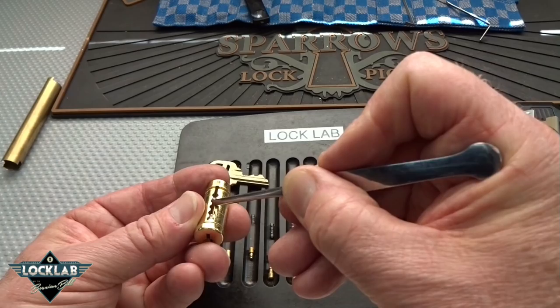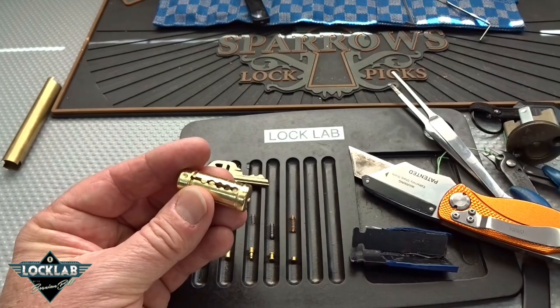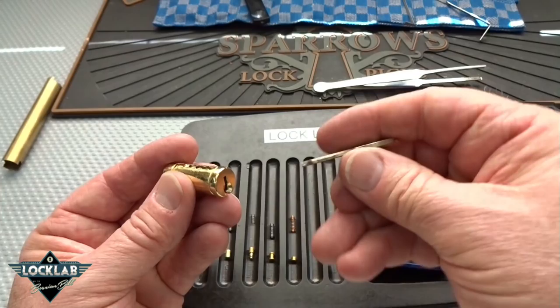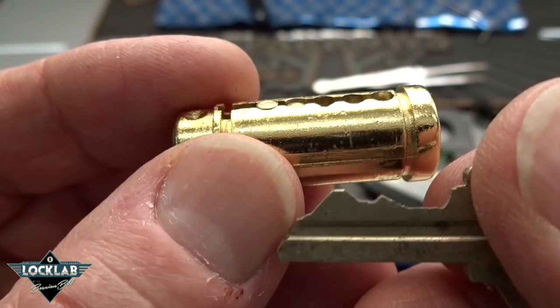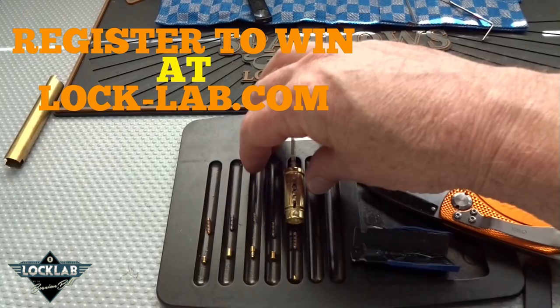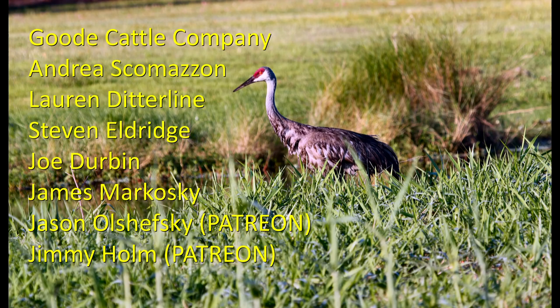That just makes no sense. Let's go ahead and pin it back up now that I've got this out — drop all five pins back in and see what that key does. Okay — pin five is already below the shear line so it does nothing. In effect this is a four-pin lock; I don't even know why you'd bother pinning that guy up. And number four apparently rides on the bow of the key — you can see just a little groove on the end there. What a weird setup. That's pretty tough for a four-pin lock though, I've got to say. Torch — amazing creativity, though I would have taken advantage of pin number five. Thanks for the time, guys.